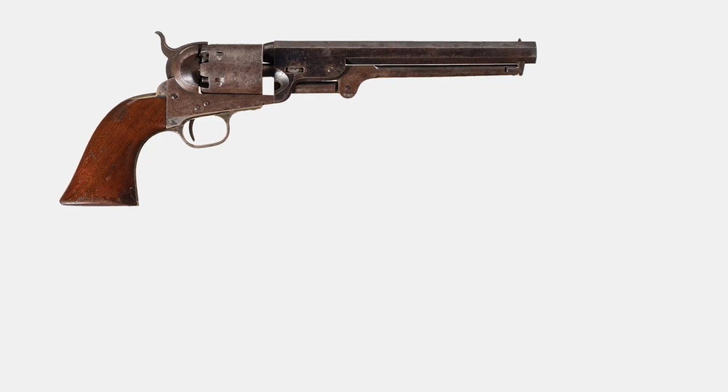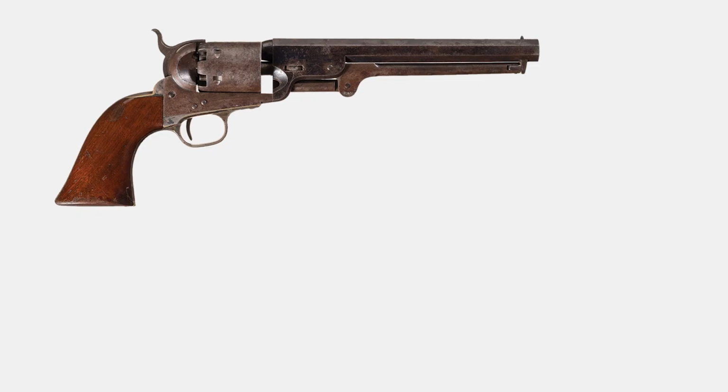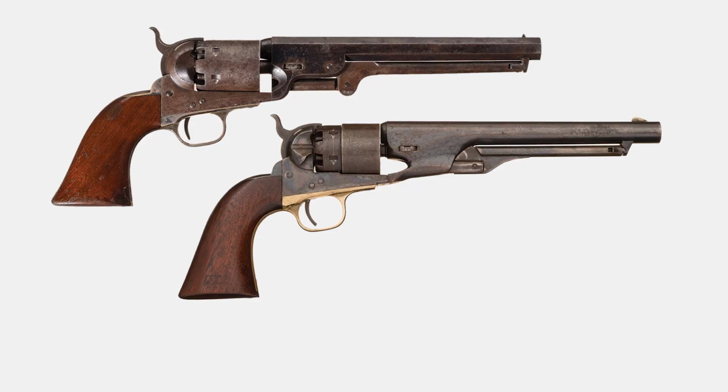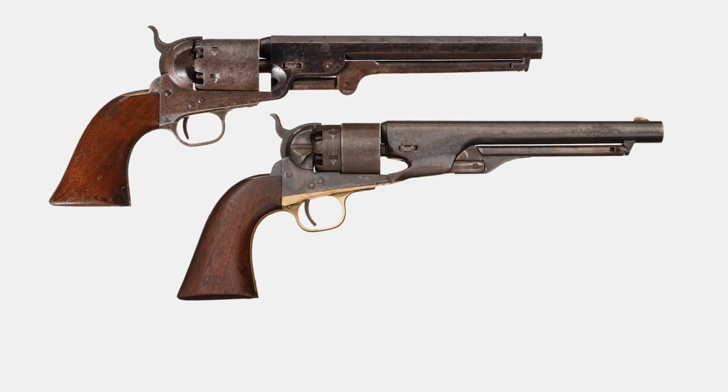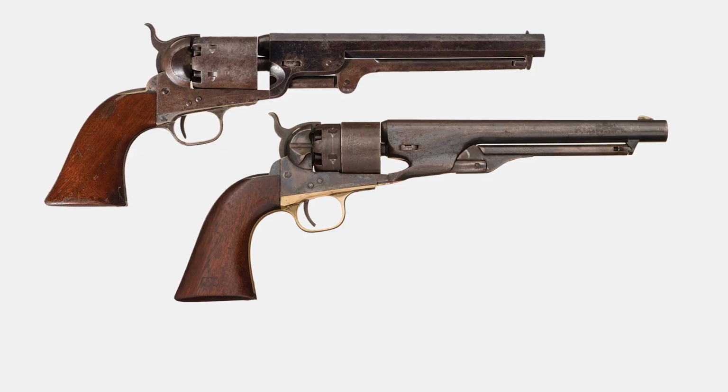So, Colt saved himself a lot of time and money in terms of machine cost and managed to keep everyone happy at the same time by simply using the Navy frame and the back third of the Navy cylinder with an oversized set of chambers at the front. This jumped up cylinder required a matching cut in the frame, allowing the Model 1860 to have the same dimensions as the 1851, but a larger bore.